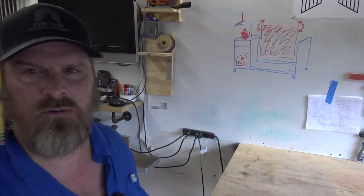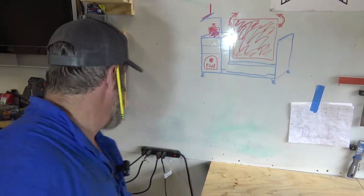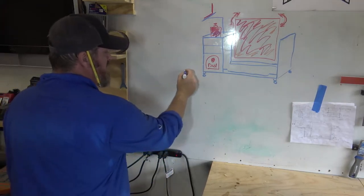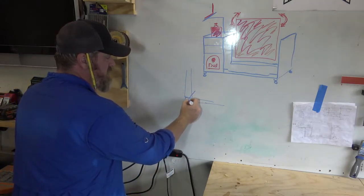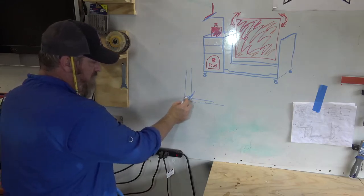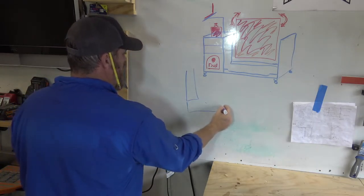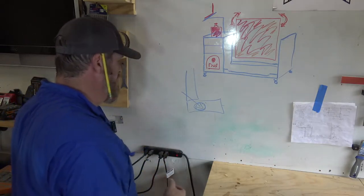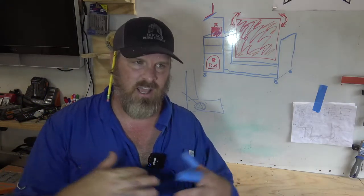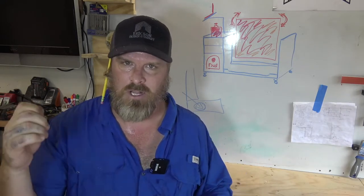Let's talk Kreg jig real fast. A couple of things you want to know about the Kreg jig and the way you're laying it out. Say we have a forty-five-degree corner and we're trying to go into this base plate. If we run our Kreg jigs on the inside going this way, it doesn't give much purchase right there — it tends to want to break out. So when you're doing that, you want to run your Kreg jigs down into the meat of the wood. That will allow for twice the strength — that's the way it's designed. They make the plugs so that if it's on the outside, you can plug it up and clean it up.